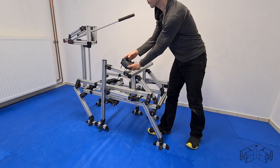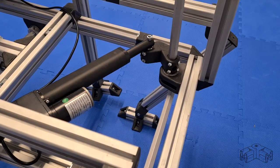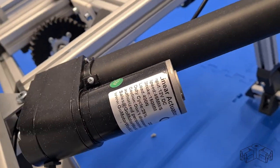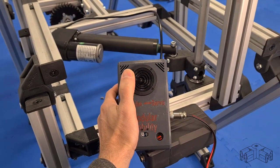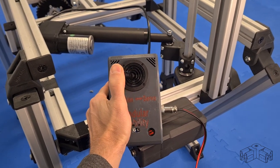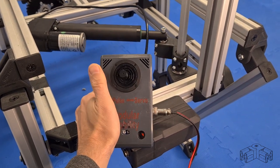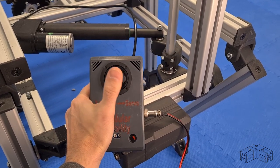The mass driver cannon at the rear is also controlled by the joystick via a second Arduino. The black drive is a linear electric actuator with a potentiometer that allows closed-loop position control. It moves proportional to the stick movement and returns to its center position when the stick is released. This unit is meant to be used as a power steering for future rides. I am an electronic newbie, so I spent a couple of weeks soldering, programming, and cursing. But finally, it works.